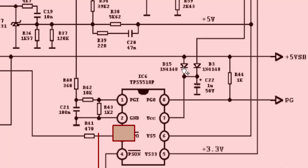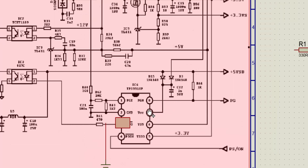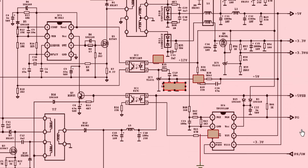The second step is to disconnect or remove these two diodes. When we remove these two diodes, pin number 7 will be disconnected from the supply, so if you increase the voltage, this IC will not be damaged. If you take more than 12 volt, the IC will not be damaged — otherwise if the VCC voltage goes above the limit, this IC will be damaged. Then disconnect this resistor at pin number 1 of this optocoupler, and disconnect these two resistors from pin number 1 as well, removing this connection point.